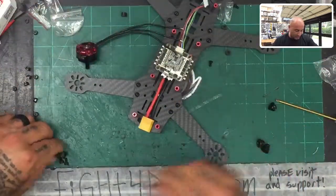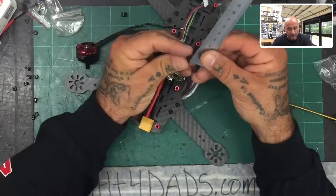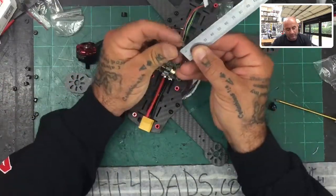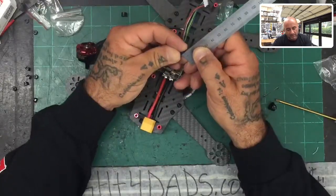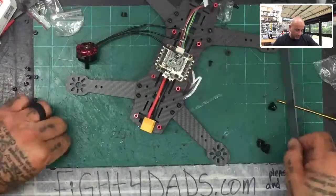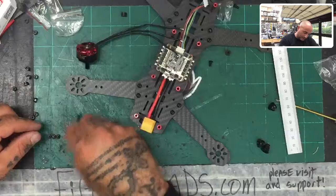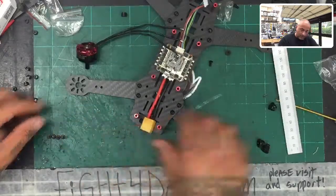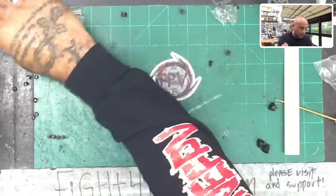Use 120 millimeters as your guide number. About the screws — you're going to get six, seven, or eight millimeter. You measure from where the thread starts, not from the bottom. Six millimeter is going to be the screw we use. To make sure you've got them right, just stand them up beside each other. So we're going to use 120 millimeter wire and the six millimeter screws.